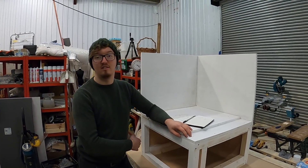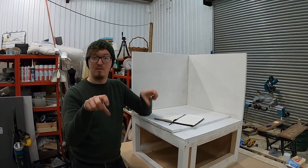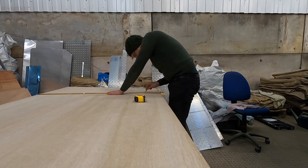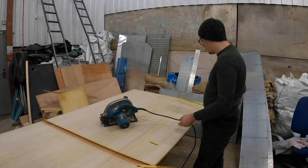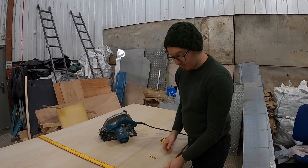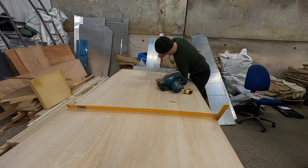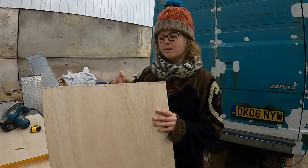Once the drawer box is in, we're going to have a separate face piece which Sophie is currently designing — another bit of ply with some trim. So I'm going to focus on building those boxes while Sophie works out how the front pieces go. We've just measured out using a tape measure and taken this four-foot drywall square, which has been so useful on this build, to put some marks on. We've got it marked and we've overrun a little with the lines so we can follow it with the saw. We're going to cut it just using a circular saw.